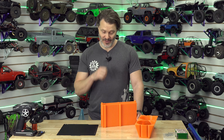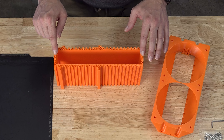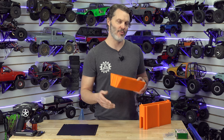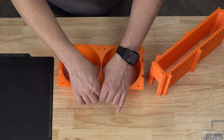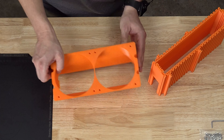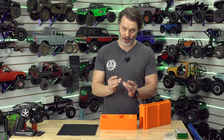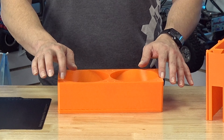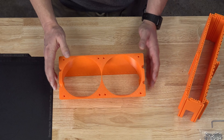I've been having a lot of curling problems. As you can see, this one rocks back and forth. I had to go from the stock ~12.5 mm³ volumetric flow rate down to 7.5, and it's still not totally fixed. These things were really bad because we have a thin shape with a thicker top, and the way that it cools — especially with the thicker sides — it just pulls it. Not only does it make the sides go up, but when you bolt it down it curls in like a taco. I did a single wall on the outside and three walls where the holes are so it'd still be stiff enough.